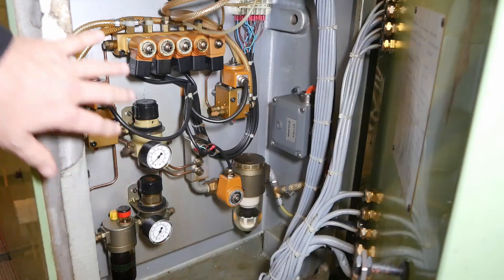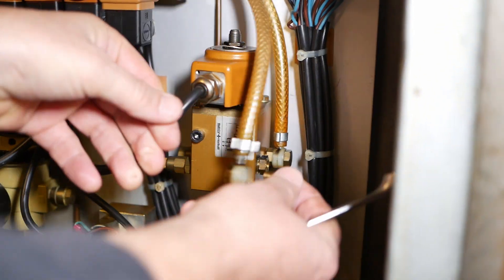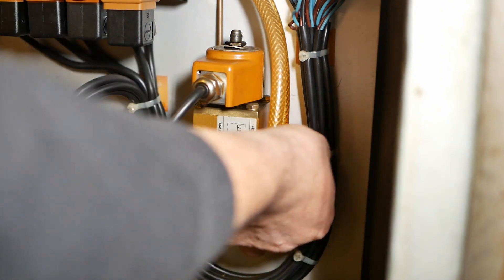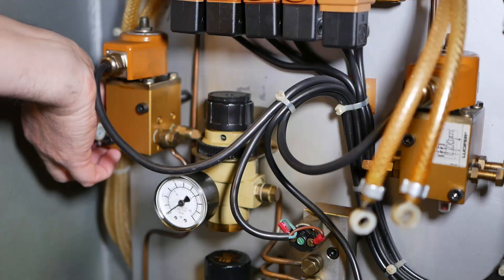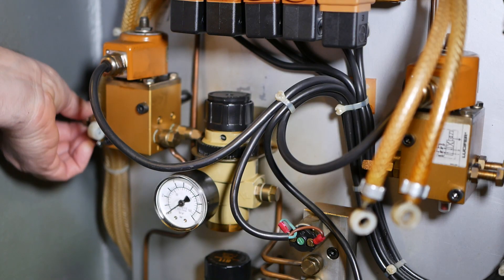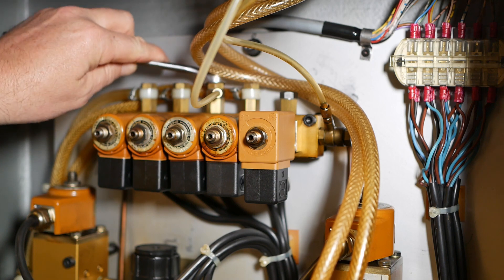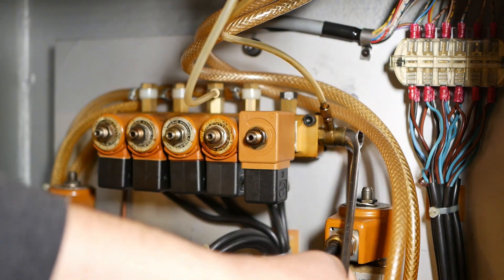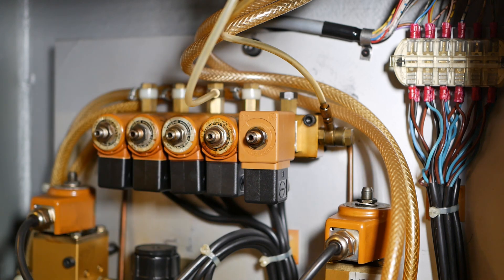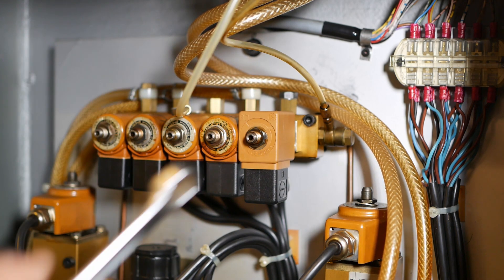Next, let's take out the pneumatics module. I'm kind of surprised doing this with plastic fittings — I'm surprised they're still functional after all these decades. It's going to be fun compressing all of this into a smaller area. These two skinny tubes go up to the tool changer. That's already a problem because if I move all the pneumatics down to the bottom, those are going to be too short. So maybe the pneumatics are going to have to stay at the top.